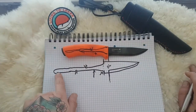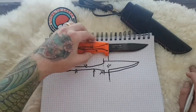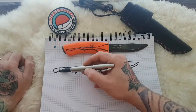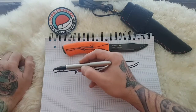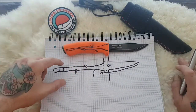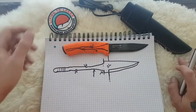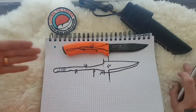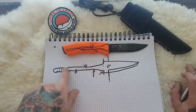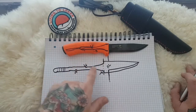On the blanks you see these extra bits, and these extra bits are missing from these knives, and people often ask why they are there. They're on the blanks to allow you to tap and die it like you would a wedge tang. So if you're making a Puukko handle and you want to just put your bolster on it and mechanically fix it with whatever method you choose, whether it be washers, nuts, bolts, pressure rings, that's what that's there for. So the blank gives you all these kind of Swiss Army knife options to allow you to try your best at handle making at home.